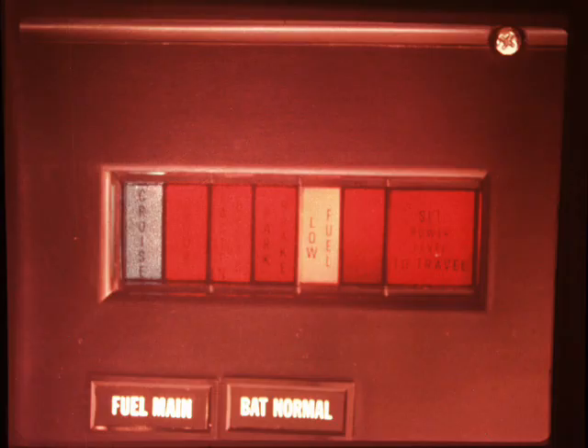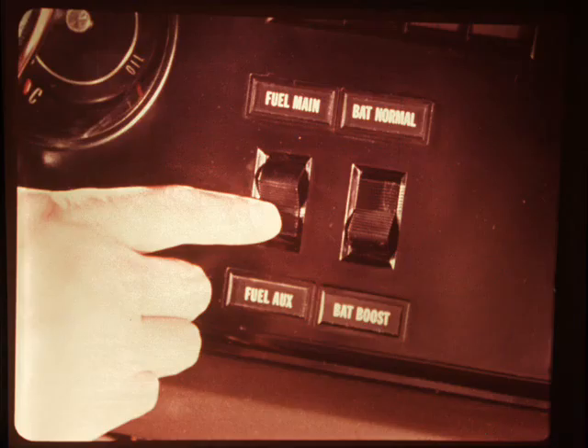When the main tank has less than five gallons left, the optional low-fuel warning light is designed to come on. When the main tank goes empty, the switch position can be changed to fuel auxiliary. At that point the auxiliary tank will contain only seven to nine gallons of fuel — not 25 gallons — because of the connecting pipe. Since the motor generator draws fuel from the main tank only, it cannot use the auxiliary tank fuel.